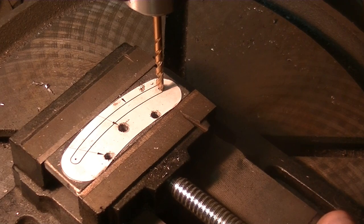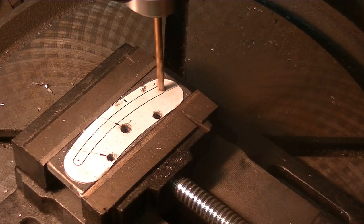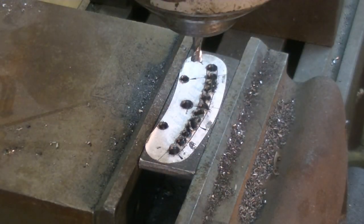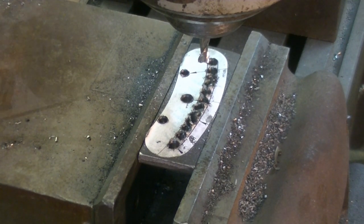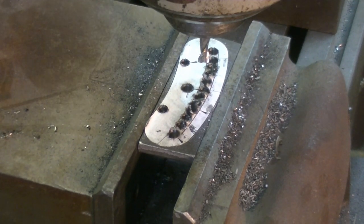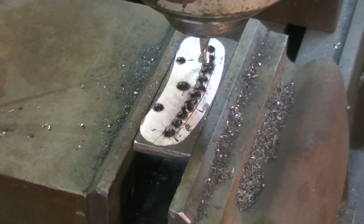So I've just spotted these two end radii — end circles, curves — and we're just going to drill through them. Now we're in the middle and I just did a bunch of holes on the drill press, so now we're just going to have to clean between these holes with an end mill. This is all just to reduce the amount of work I'm going to have to do in hand filing. We're gonna do as much as we can with the machines.